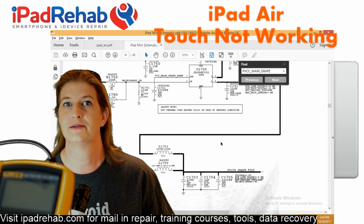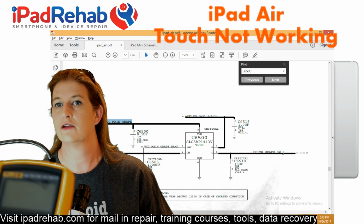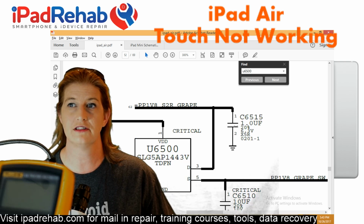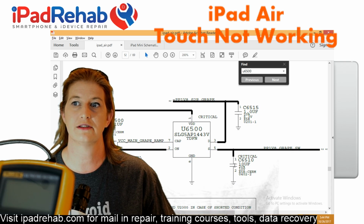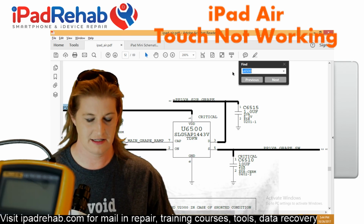Okay, so let's go back to our board and find out what's the easiest way to take PP1V8 S2R grape and make it become PP1V8 grape SW. And I think the answer to that would be, what happens if we just make a little wire from the line side of C6515 over to the line side of C6510? Let's do that. So where is C6510 and 6515?